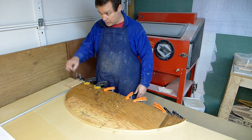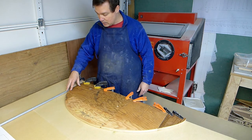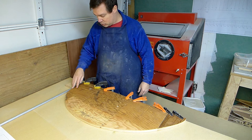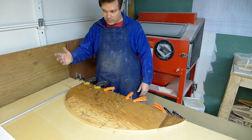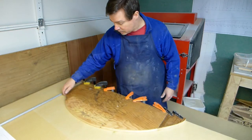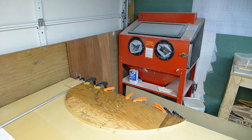I'm going to walk over to the other end of the table so I can get the other end and start bending there. I think it's not a sharp enough bend where the tubing will crush - you can bend tubing only so sharp before it starts to flatten out and fold. I don't think this is sharp enough where that's going to happen. There are springs you can put inside the tubing, or you can fill them with sand to support them while you bend, but I don't think I'll need that here.